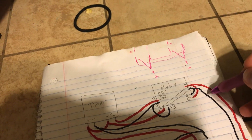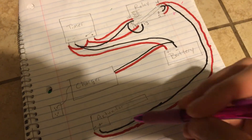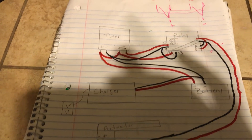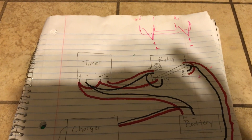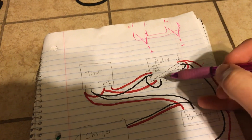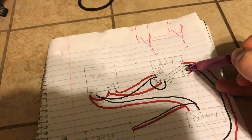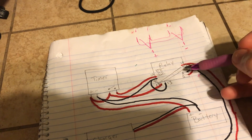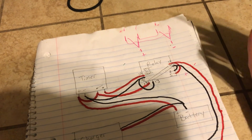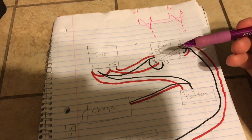So this becomes a positive and this becomes a negative when powered on — and that powers the actuator. Tried to draw it out so you could understand it, and hopefully that makes sense. There are other ways you could do it — you could reverse this and have your positive and negative coming in and flip the polarity on the other set of contacts. Either way it does the same thing; I just found this to be the way I wanted to do it. If you have any questions, leave a comment below, hit the like button, and subscribe for more. Thanks for watching.